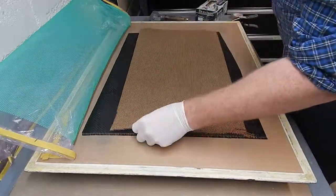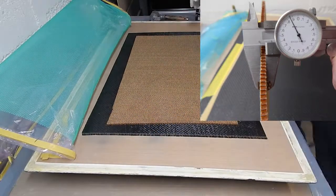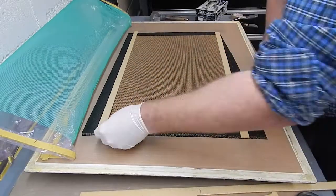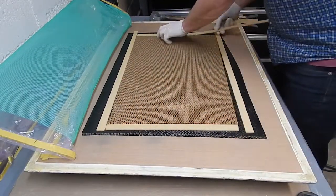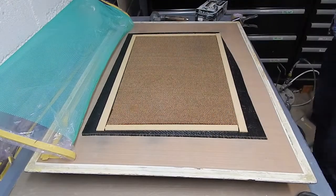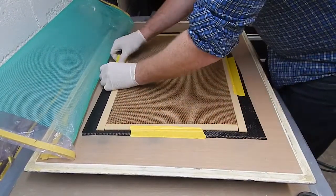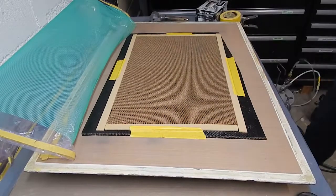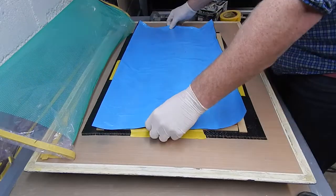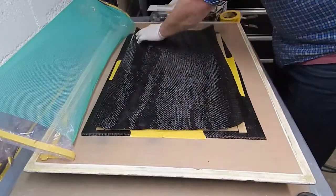This is almost 4 millimeter Aramid Nomex honeycomb. It's pretty fuzzy — it hasn't been sanded — so it's going to suck up quite a bit of resin. I'm putting these pieces of core cell off-cut around the edges just to make sure the honeycomb doesn't get crushed in, and also leaving that bottom skin wide so that when it comes time to demold I'm not going to put unnecessary pressure on the edge of the honeycomb.